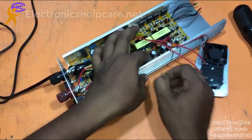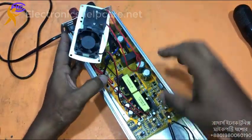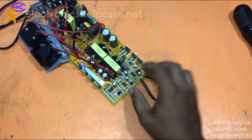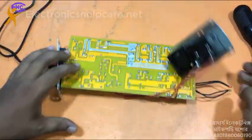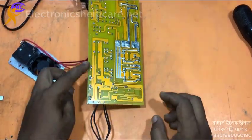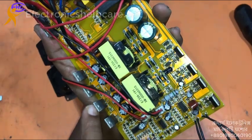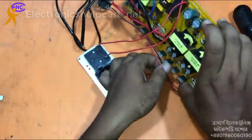Now I opened and removed all the screws. I need to take it out like this. One is the separator — be careful when using the separator on both sides. Now I need to take out the MOSFETs. This two-side board has eight MOSFETs because one side is the 12 voltage input MOSFET and the other side is the output MOSFET.